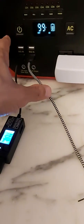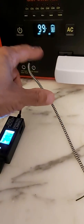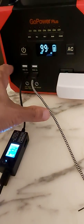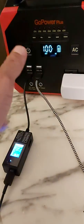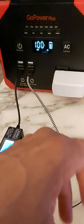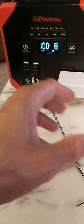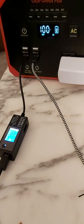You've got to remember that this unit takes 120 watts DC input. You've got to charge it up properly. So you've got to use either two 60-watt panels or one 120-watt panel — that's what you need if you want to charge this fast. Anything less will take forever. Also remember that the true voltage output on these solar panels varies — some of them are not going to give you the full rated power, so be careful what you buy.